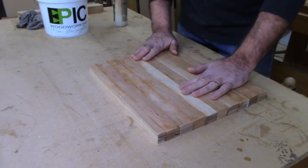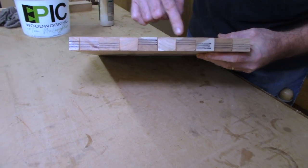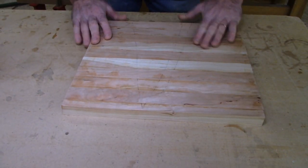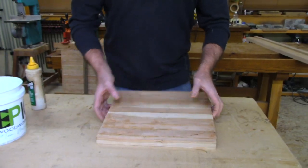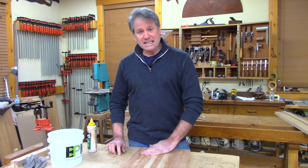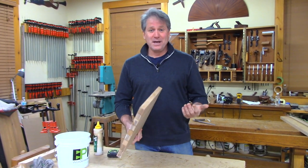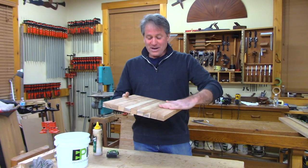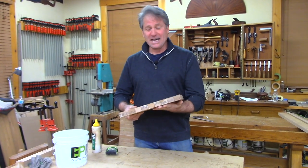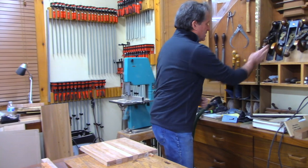After that's all clamped up, you'll have one like this. Now we want to smooth it out. If you had a thickness planer that was wide enough, you could run it through there and just lightly skim it. Or you could run it through a drum sander. Or you could hand plane it. You're going to have some variation — you do want to get this flat, because this is going to become the new glue edge on both sides. You could plane it — I'll just try the number five.